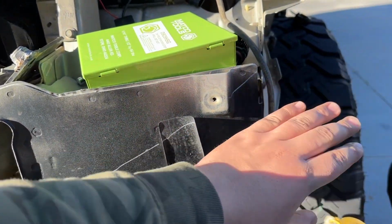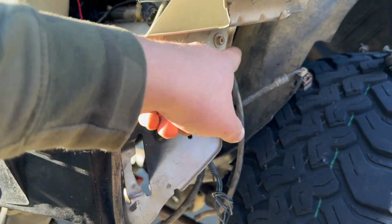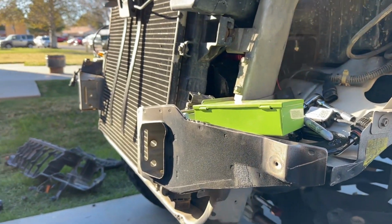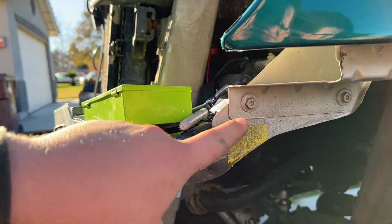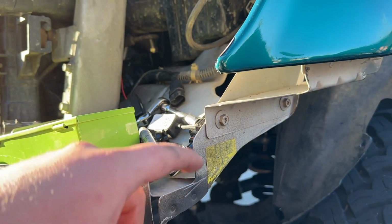And the way that the bumper is, it'll pretty much have it all covered up. So that's what we're going to go with. And then out here, cut all that, pretty much just leaving enough for the fender to hold on. So we got this piece cut out. We tried to leave spots that are mounted on there. So like the fender mounts onto this piece. So we left the spot welds here just for rigidity to the fender.